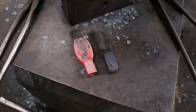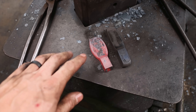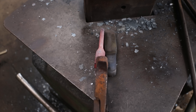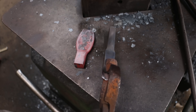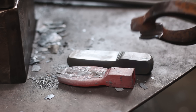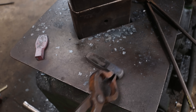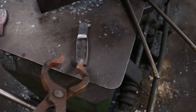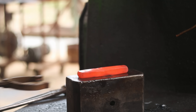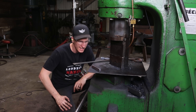So there you go — I didn't even get as deep into the throttle of the power hammer, and I did half as many blows. You can see the difference: that's almost a quarter inch gone on the mild steel, that's still five-eighths on the Inconel. That is gnarly stuff. Okay, so we understand that now. I'm just gonna heat this up one more time and try to get it to a nice square bar.